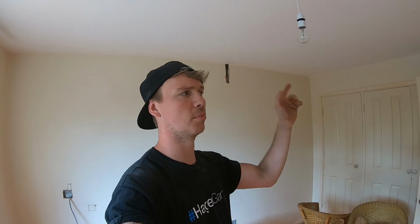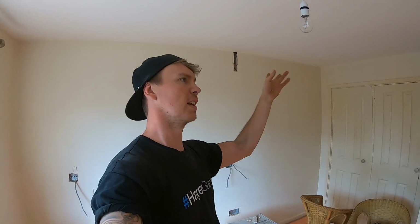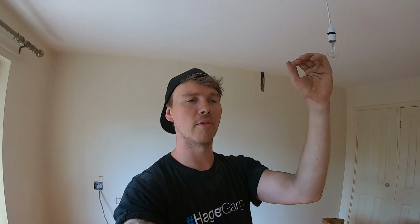There's going to be 6 downlights on a new feed, undercabinet lights on the new feed, and then they want a pendant over the island. So we're going to sort that out. About 6 sockets to put in, and a new 6mm feed for the cooker from the board, which is run into the garage across and back round because there's a flat roof we're working on. Hopefully we'll get that on footage as well, so that will be a video after this one, I presume. So yeah, I will see you next week.